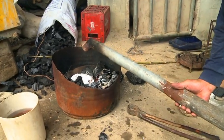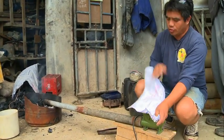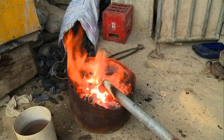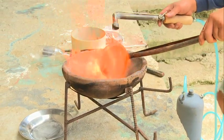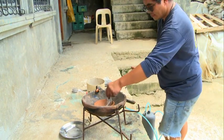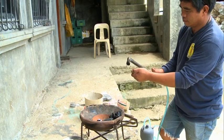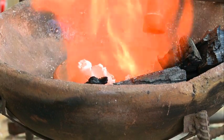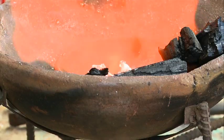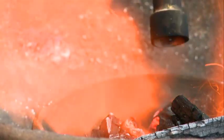We do it this way. First, you put this pipe on — I will use this to control the air, so the gold might not be blown from the sides of the clay. You can also use a blow torch to cook the mixture of borax and gold. After heating the clay bowl, simply add borax. Now I need to add charcoal to increase the heat. Within a short while, the borax will melt in the clay bowl. And now I will put in the gold. The process will only take around five to ten minutes, depending on the amount of gold.